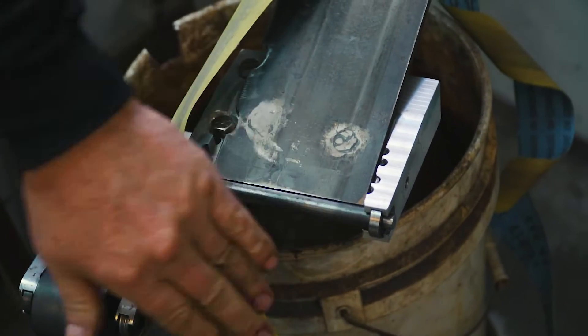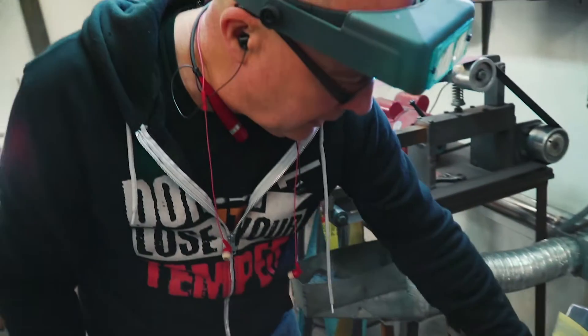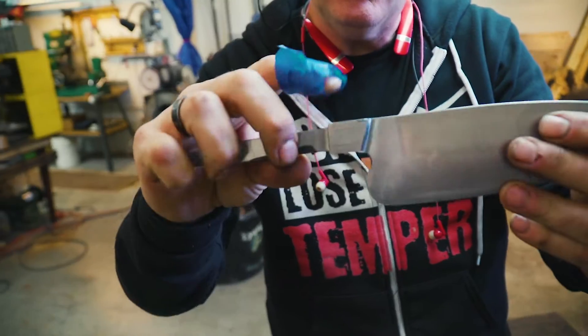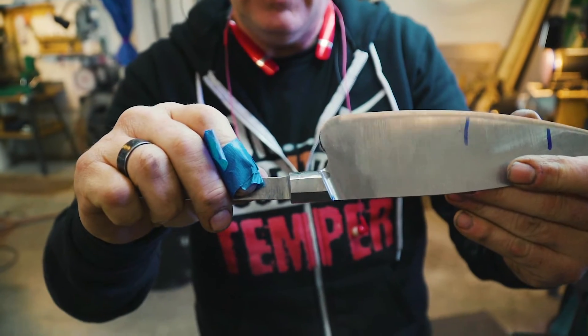This fixture is on bearings, half-inch radius, half-inch rod. It's a mild rod — it doesn't have to be anything special, just half-inch mild rod. It's got to be straight. And now I'm grinding in the Ricasso. With the facets on the Ricasso, here's what it looked like before, and there's what it looks like with the grind in it.